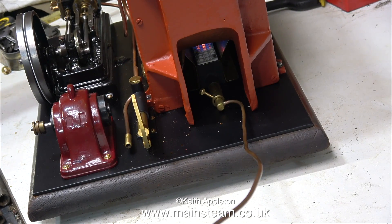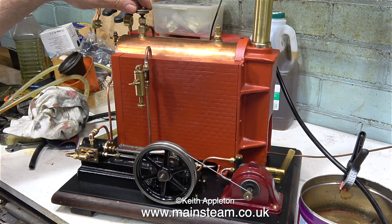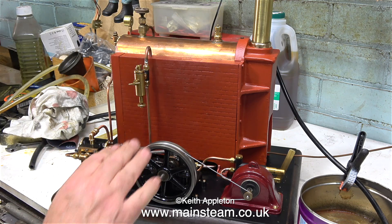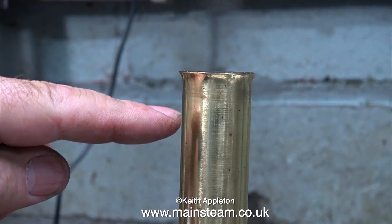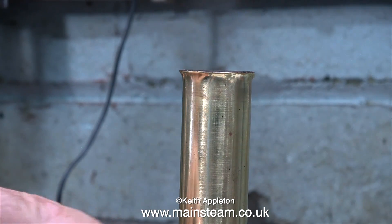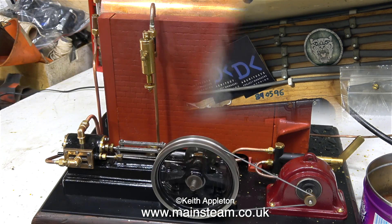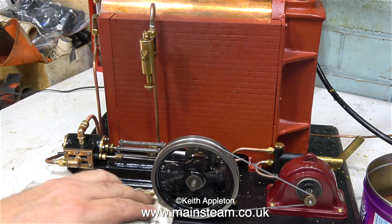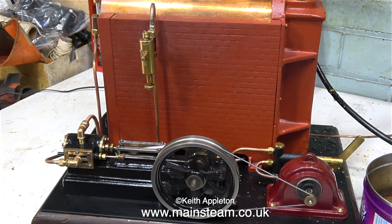Time to light the burner and test the boiler — for two reasons: I want to see if the paint burns off again, and I want to see if my chimney condenser works. In no time at all there's a tiny amount of pressure, and with a quick flick of the flywheel the engine starts with no problems at all. Except the pipe that I've put in the condenser is too long — the water's coming out of the pipe and splashing on the baseboard. When I was making this pipe I thought it might be a bit too long, and sure enough it is.